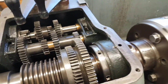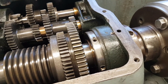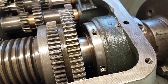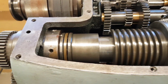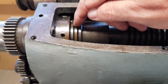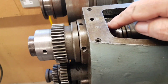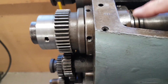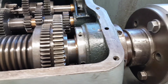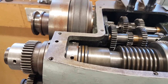So the bearing setup - this is for Ben. No, it's not a tapered roller unfortunately. It is bronze. And if you look down inside of there, you can see the end of the bearing protruding. You can't on this side because that is a ball thrust bearing there. But on the outside of here you will see there's a locking ring and another locking ring. The damage to the locking ring has not been done by me on either side - this is as I got it.